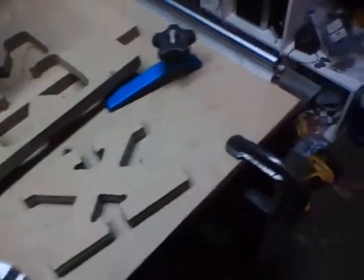Another thing I've noticed: this was cut with the only bit I had. I used a straight cut bit — a straight flute dado bit for a router — which was the wrong bit to use. Basically what it does is it cuts, and then it puts the sawdust directly behind the bit, still in the groove, and leaves it there. Then all it does is keep going around, wallowing in its own dust, burning and making smoke and mess.